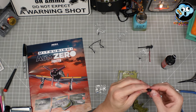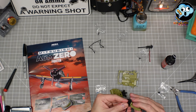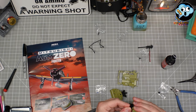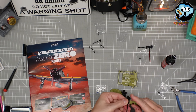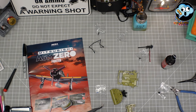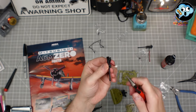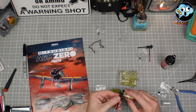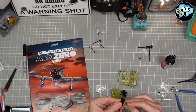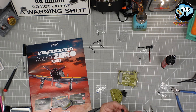I think we might have to rotate the little pins a bit on these LEDs to get that. There we go. That looks more like it. And does it actually fit into the groove? It's supposed to fit into the groove. Okay, so I'm going to pry on these very carefully with some needle-nose pliers. I have a smooth-jawed, no grippy teeth on these. And we're going to ever so gently rotate so that the leads are flat to the side. And then get it in there. And that should hopefully allow us to get in there.